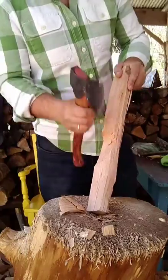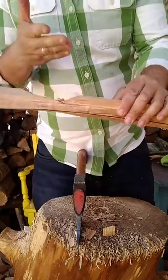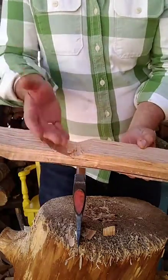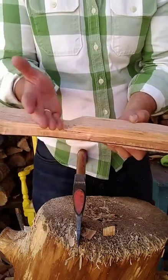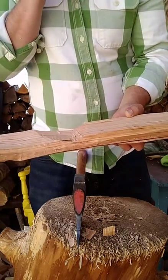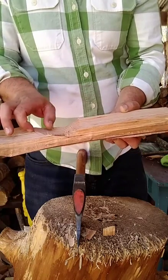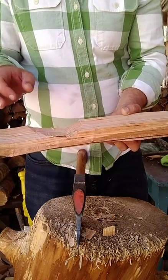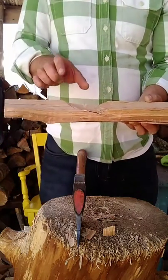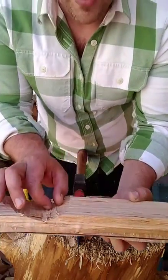There is a relationship between these two cuts that's important. With the exception of a scoop, where all I do is just come in equally from one side and then the other side, if with this one you do your bowl cut and then your stop cut is too shallow, what ends up happening is it ends up creeping up and making your bowl shorter and shorter and shorter, even as you keep cleaning up this bowl face. And that's important because you want a bunch of the bowl to be up here and then just the last fifth to be down there.